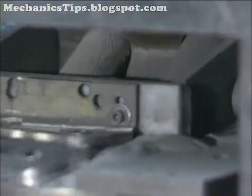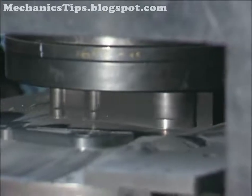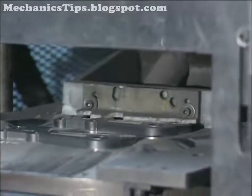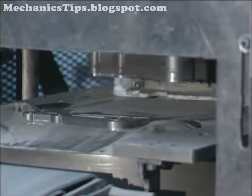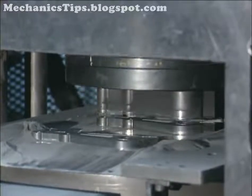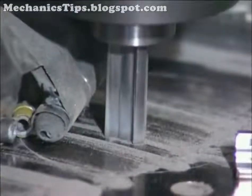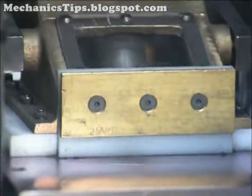Part production rates are high, from several hundred to thousands of parts per hour. In mechanical pressing, the powder is automatically gravity-fed into the die of a mechanical or hydraulic press and consolidated to a specific density. Pressures of 10 to 60 tons per square inch are created by the vertical action of an upper punch, or by the double action of an upper and lower punch. Pressing is typically at room temperature, although elevated temperatures can also be used.